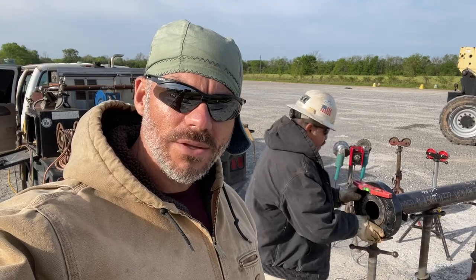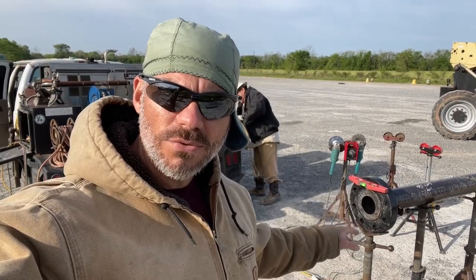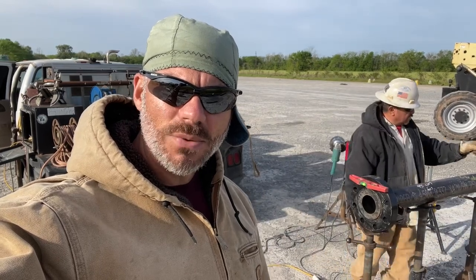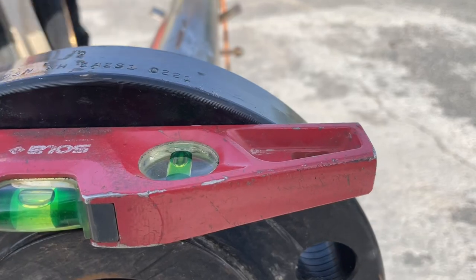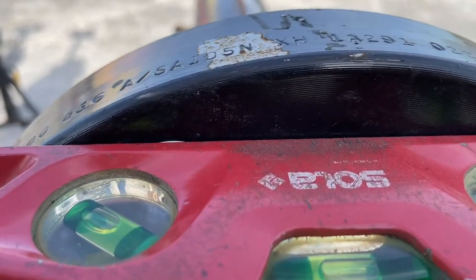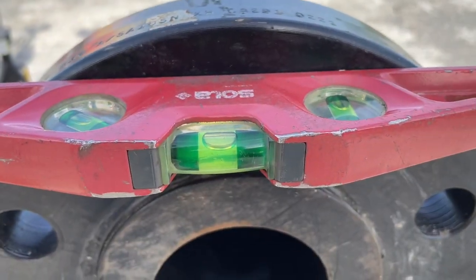Jose is showing a little trick right now — we don't use two hole pins anymore. I used to, but I haven't used them in years. All we do is line the level up on the two holes. That's why I love those red levels — it's got one big fat magnet right in the middle and it's easy to stick between the holes. Just a little bit of daylight in that one, and a little bit in that one, and it's not quite level but it will be.